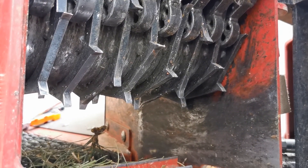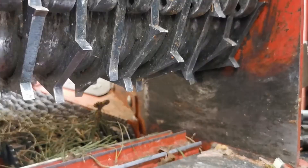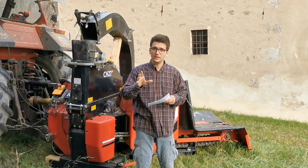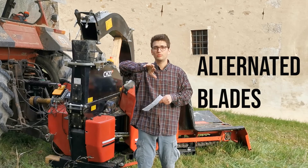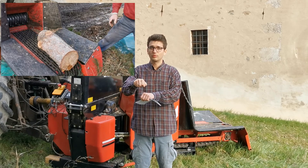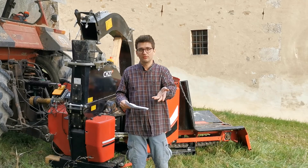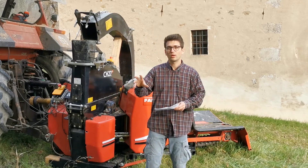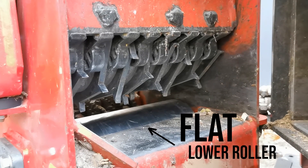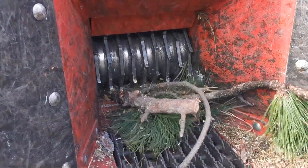Notice their special geometry. The upper roller has hooks on it — they are really effective because they can stick into the wood, grab it and move it very easily. The lower roller on the contrary has linear plates, with tips similar to blades, and an important detail is that these blades are alternated: one is used for forward motion and the other for backward motion, for situations where you want to retract the wood away from the rotor. The red rollers shown in the video are the originals, but at the moment we have mounted homemade ones specifically designed to work with woodworking production wastes. The lower one is completely flat so tiny pieces don't get stuck, and the upper one has very sharp non-aligned hooks in order to grasp flat materials like woodworking production pieces very easily.